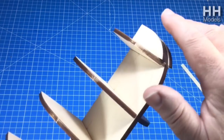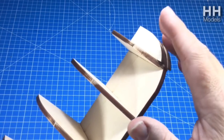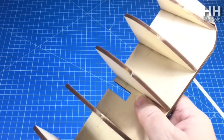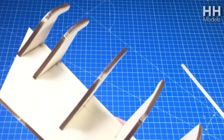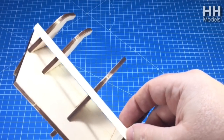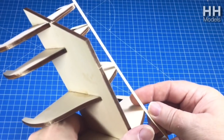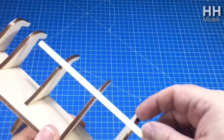If you chock it and you fair it, sometimes all you've got to do is basically bend your plank and glue it on. Because if the hull is the right shape, there's no real issue — I managed to do that very successfully when I repaired the bounty. As you get to the stern, you'll have a similar problem. So again, fairing and smoothing so that the tricky shape is reflected in how the planks sit on there.